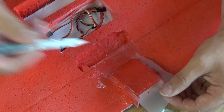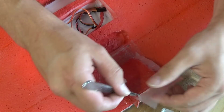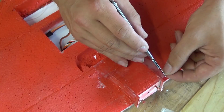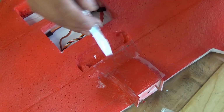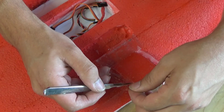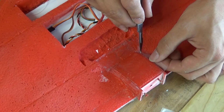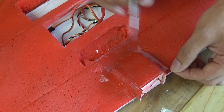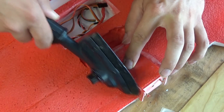Brilliant. Just get the knife out. Cut on that back edge, like so. I'm going to tidy up this seam as well. There, we need to cut there. We need to cut there, and then because we have got a ridge going over the side, just putting lots of little cuts in there. It allows the laminate to bend around the join or around the curved edge, and there we go.